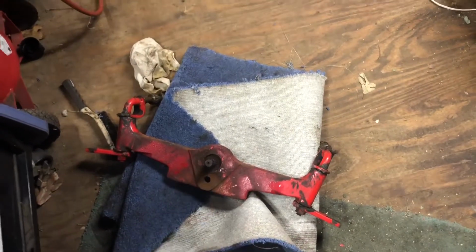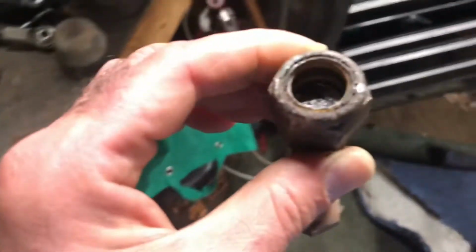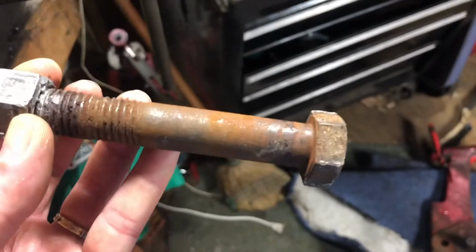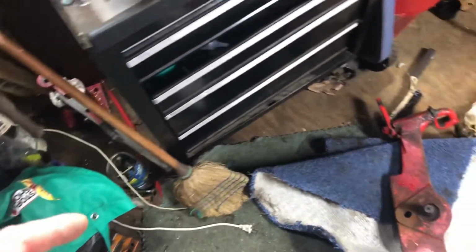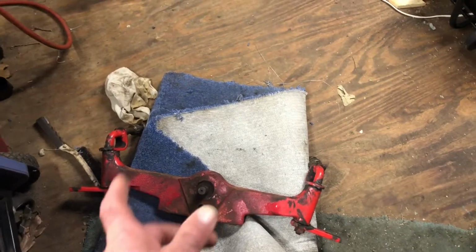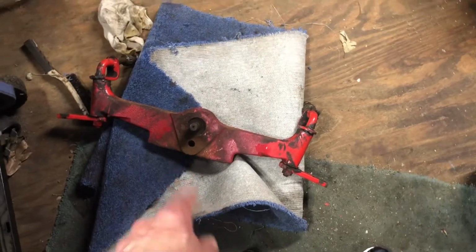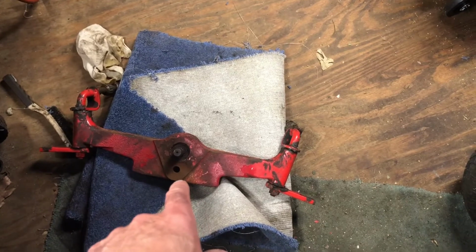I got the axle off. In the last video, I struggled to get this bolt out. It's a very decent sized bolt, but it wasn't overly rusted. But it basically needed a 3/4 inch impact wrench to get it off for my neighbor's house, and luckily it worked. If that didn't work, we had a 1 inch. So got the axle off. It's just literally because that was loose already, because this always moves. I was able to just knock the bolt out, and this dropped right off.